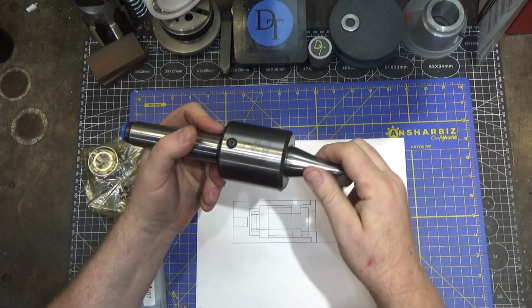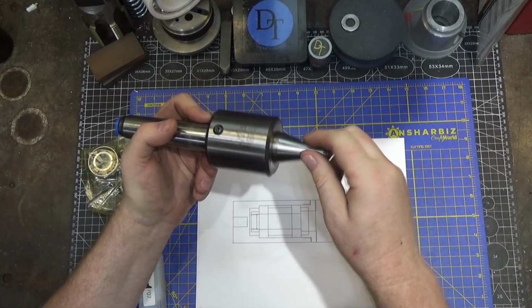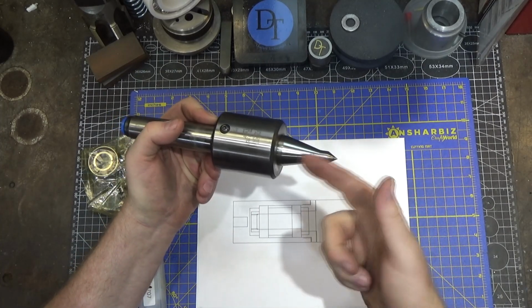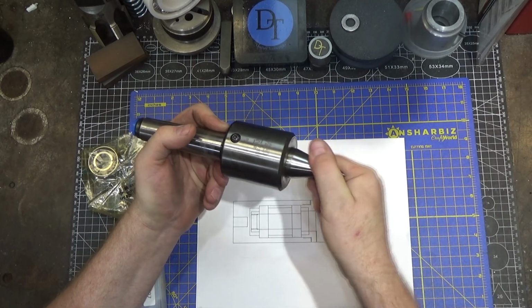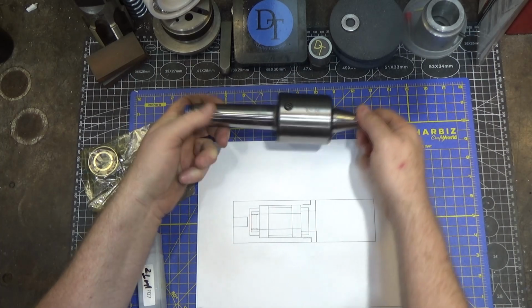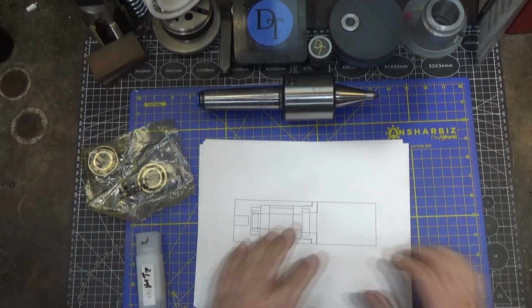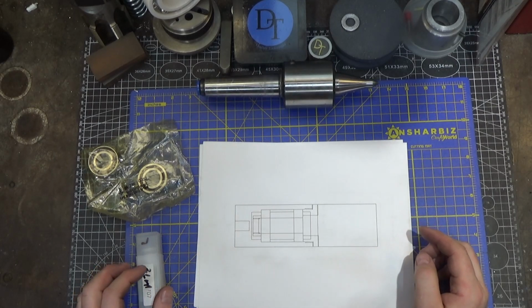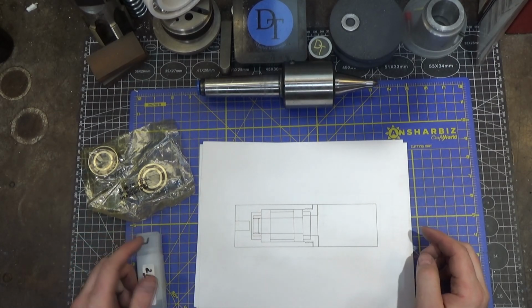So this is a live center for my lathe with a Morse taper 4 on the back, and you'll notice that there's a fair amount of friction, like it doesn't free run, and that's because they put a lot of preload on the bearings, so there's almost no run out on this even under load. And that is a good thing for a live center. However, there will be no load on the end of this particular center because it is just rotating a part